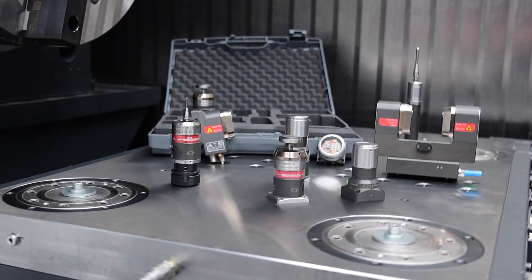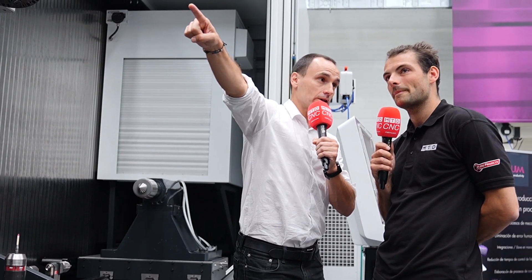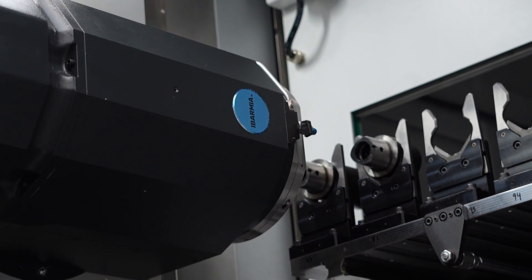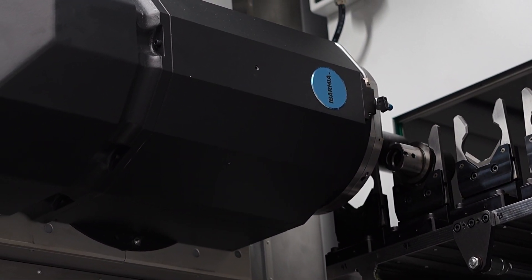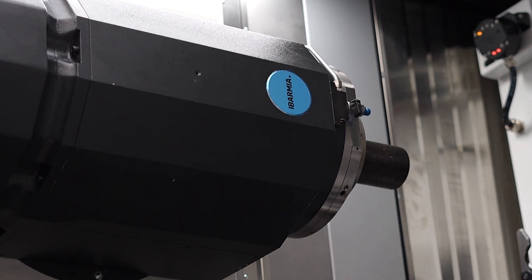The advantage with Ibarmia is that since you have these platforms, you can be machining all kinds of parts. You can be doing five-axis jobs by integrating a rotary table on top of these platforms. You could do so many different jobs — even have the machine as a horizontal machining center because the B-axis can come down and machine up 90 degrees. Apart from all those things, you have the capacity to change long boring bars and extra large tools, always keeping in mind that you have a very strong milling spindle here. And I love the fact that you can do probably almost every operation on this machine because of the tool changing capability — on other kinds of machinery you might have to hand load those, increasing cycle times and operator intervention. With big parts like this, cycle time is of the essence — they're already kind of 40 hours sometimes, so getting that time down is really important.